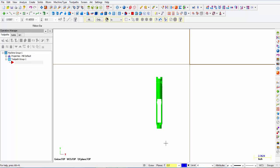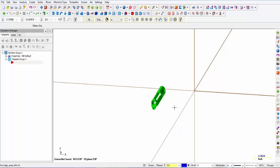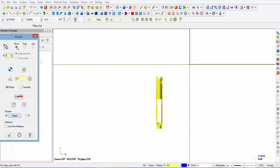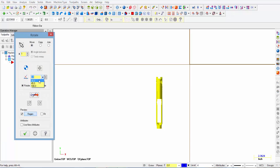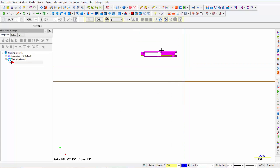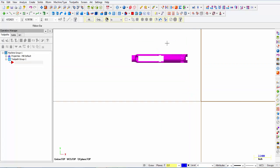I'm going to rotate this slide 90 degrees so that the front of the slide is facing to the left. I've highlighted the part, I'm going to select move and then pick 90. You can see it's giving me a preview and I want to go the other way, so I'm going to reverse the direction. It says do you want to move the defining wireframe entities — make sure you say yes. Now I have it in the correct orientation the way I want to set it up on my mill.